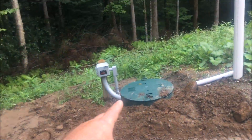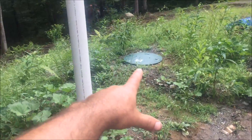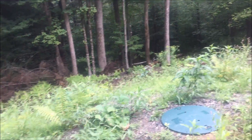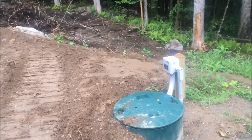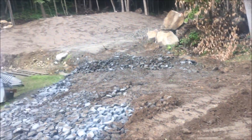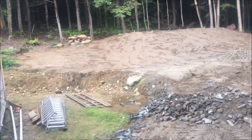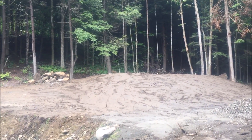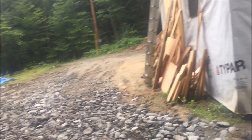Coming back to the tank here, you can see that it has electricity being fed in. There are actually two tanks here — one would be the septic tank, commonly about a thousand gallons, and then it flows over to the pumping chamber. This one would be the pumping chamber, and then it pumps it up the hill into the leach field. The leach field is your waste disposal for the wastewater — that's how they're putting the water back into the environment safely.